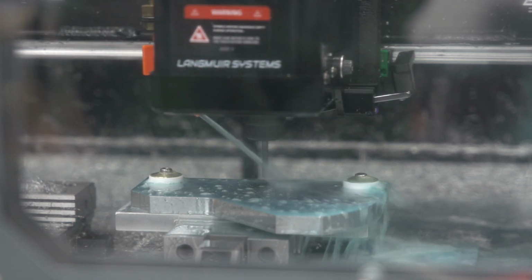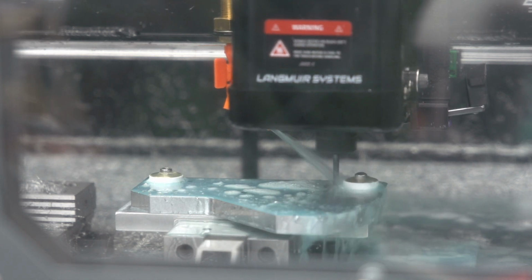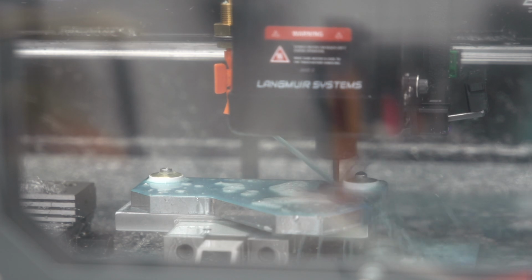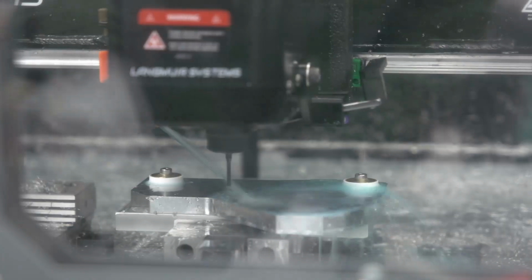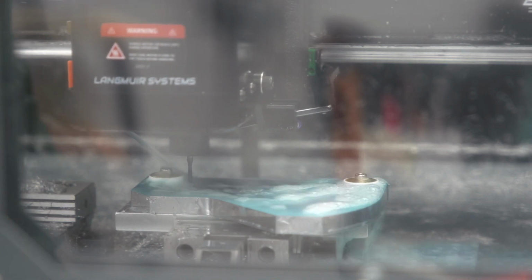Running an M6 tap drill, well, a drill for tapping. And we got really close to these washers. You'll see when I do the chamfer pass how close things get. It gets really close. And now the threading end mill. I think it does about 6 passes or 5 to finish threads. I don't know what a good number is for an M6. I'm trying not to be too aggressive because it's a tiny little tool, so you want to go easy.